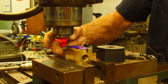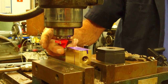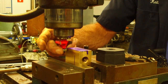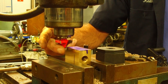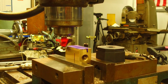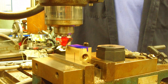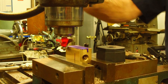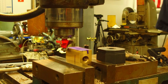First off, I'm locking the knee, taking all the slop out of Debbie here, and then a little bit on the X and Y. I'm just coming in and free spinning this with my finger. Okay, I can feel it dragging right there. So I'm going to call that zero on the contact here, and I'm going to set in and out at zero right there. Theoretically now all we need to do is run our router bit or radius tool